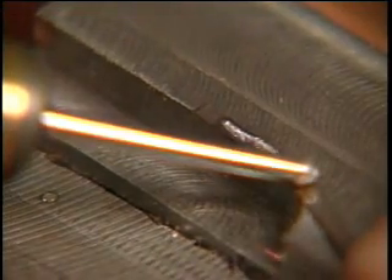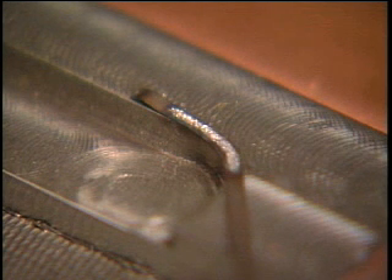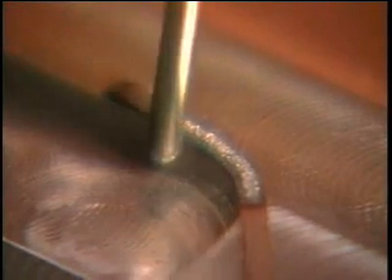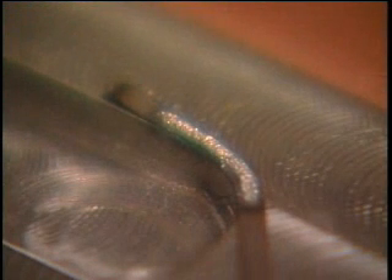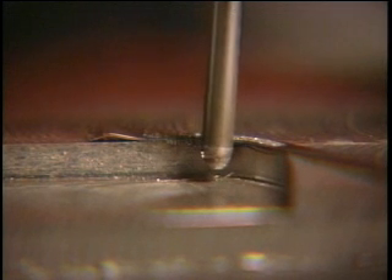Lying the electrode down and welding with its side may increase its contact area and substantially reduces the weld penetration, and may produce an inferior weld. An exception is when you want to go back and fold the weld material over the parting line — you can use the side of the electrode along the edge of the repair material. Working on a corner like this requires firm pressure with the electrode to prevent excess sparking. Setting the power to a lower setting can also help. Use the side of the electrode, slightly tipping the handle ahead in the direction you want to roll it, to ensure that the material folds down and not up. This procedure can be repeated as many times as necessary to form the repair material to the proper shape and minimize finishing.